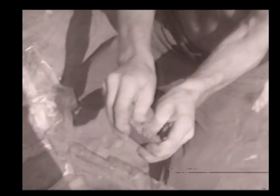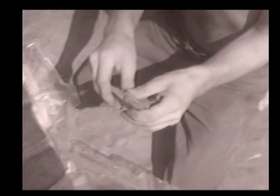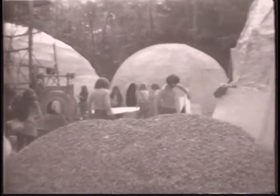This is green concrete, but you see that even with green concrete, it's hard to pull apart. It's only 4 days old. I'll give you another piece. Watch out for your fingers, though. That's the whole point. Now, the revolutionary thing about this method is that you lay out the reinforcing with the mix, so there's only one operation. When you lay out the cement mixture, it's got the reinforcing already in it. It eliminates the enormously laborious task of laying up mesh reinforcing, which is the usual method of doing ferro-cement.